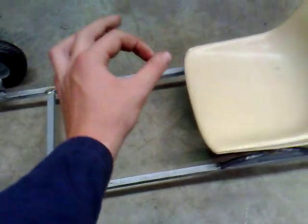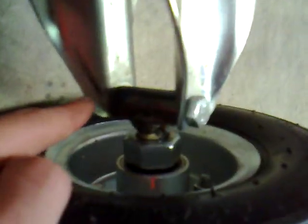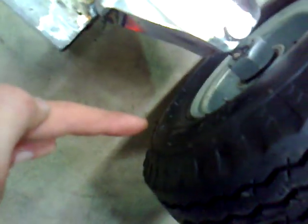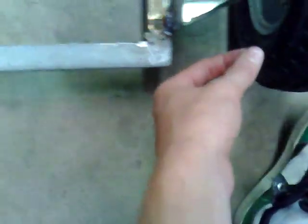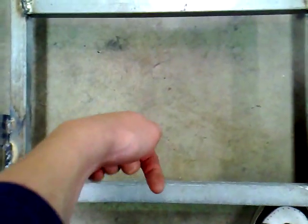Having said that, I'm going to put a bar across here for the steering wheel. I'm going to use a mountain bike - it has a steering wheel shaft and I'll just make that shaft longer. I'll cut one of the handlebar clamps off and weld one down to that bar, so you'll have a bar going down, a bar across, and then the steering wheel shaft going down here. Off those little circle bits I'll weld a bar out, then weld another bar fully across. My dad suggested having a thread and two adjusters in between so you can adjust them so they're both perfectly straight.